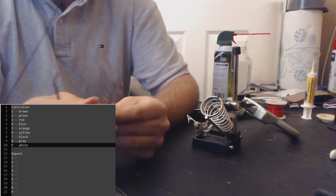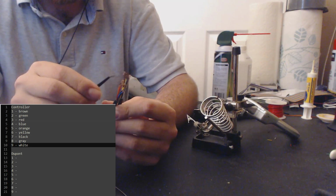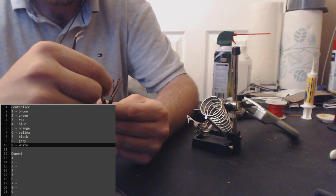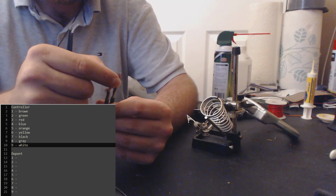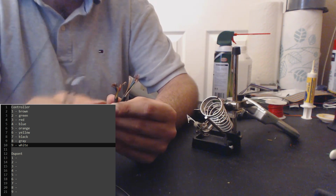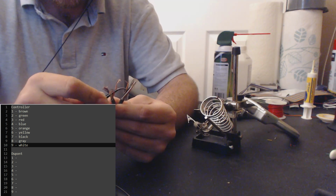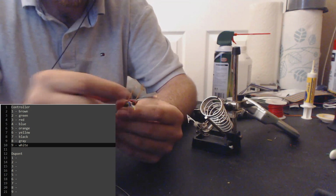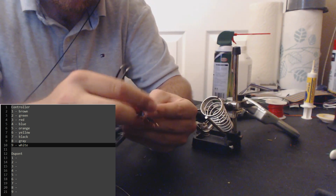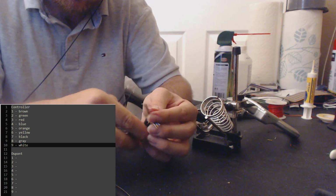Okay. So all we're doing here for this part is you want to fray the copper on both sides, like fray it apart. Spread the strands apart on both ends, so it's kind of fanned out. And I like to use tweezers a lot during these steps to just move things out of the way and isolate. So we can isolate these two orange wires like that. And then you just want to twist them together. So get them all mixed together and then just hand twist.